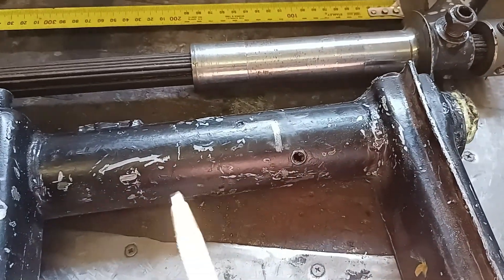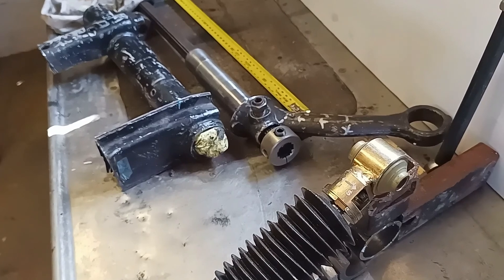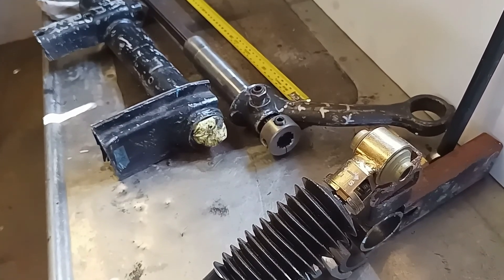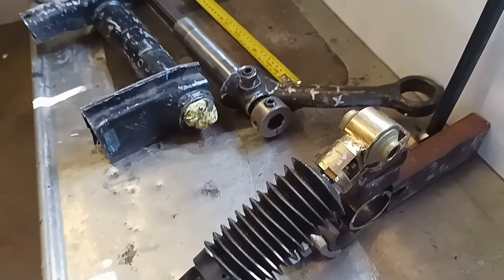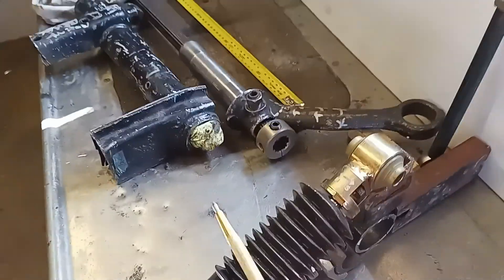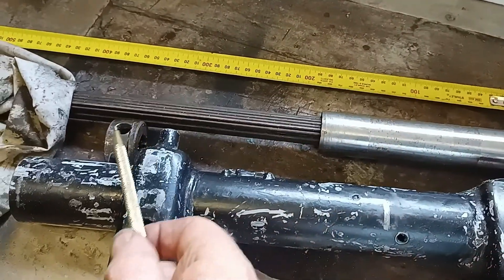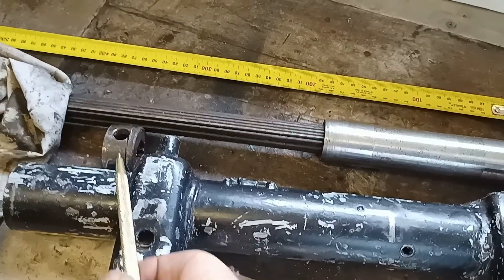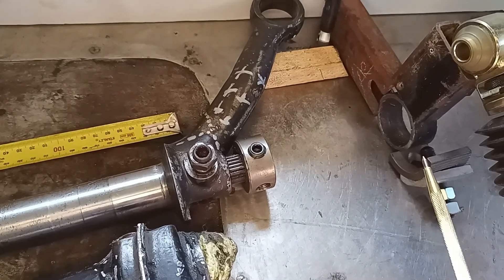This tube is part of the chassis. There's some fabrication to do, but it's not particularly onerous. The more onerous issue will be in the setup of the preload and where the holes are drilled to mount this at the correct angle — to clock it correctly relative to the bell crank.